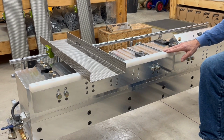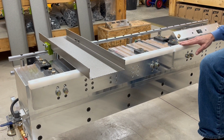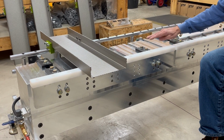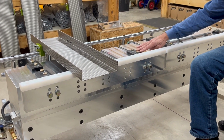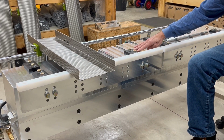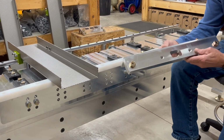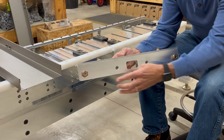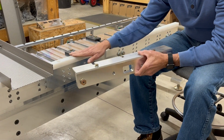Okay, another benefit of all Radial Pro shaker systems is the fact that they include tray support platforms. Now, these tray support platforms can be mounted with either adjustable T-slot tongues, as we're showing you here, or with adjustable faceplate mounts. Now, if you purchase a system with adjustable faceplate mounts, we will provide you with a transfer drill template to assist you in locating and pilot drilling the mounting holes for the tray support platforms.